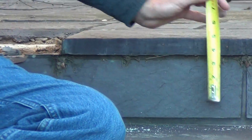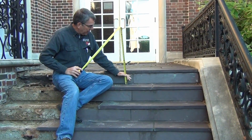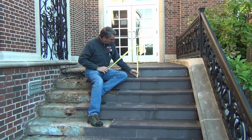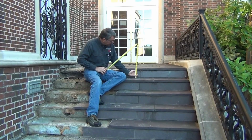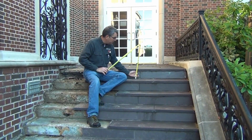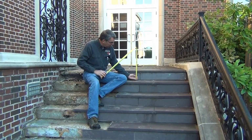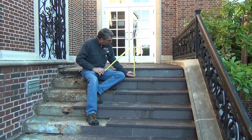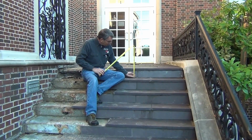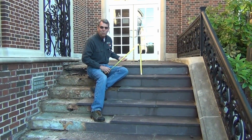Okay, this is 6.5 inches. If say you're gonna add 2.5 inch material, then already we need to lose 1.5 inches, and we don't have any fall, and that's probably 15 feet. So we'd like to have 1.5 inches, 2 inches of fall. So now we're at 3 inch. And so you can't just shave some of this off. You gotta tear it off and re-pour it.